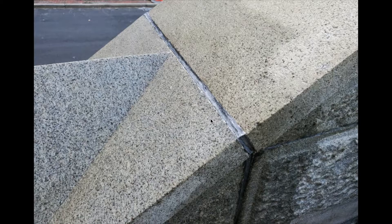Here is Richard's work after we've finished filling. You can see right here, there's lead. We used a half-inch diameter lead coil and rammed it in there so that it's large enough to span the gap and be able to ram tightly up against the edges of the stone. So there we are — that's the completed fill. And you can see over here, this has been dressed to be more consistent as well.